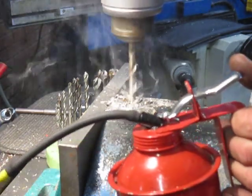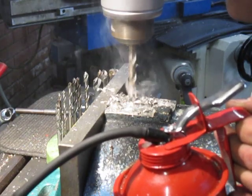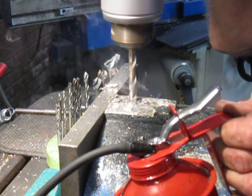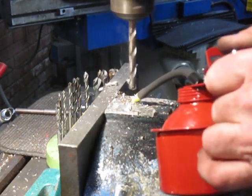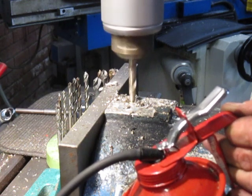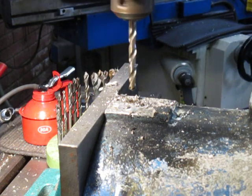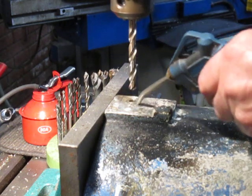Said before, the most important thing for me is to get through the stud so that I know exactly how far I have to go with whatever. So if even any piloting of any sort, we want to get down and get through first. And that then tells us if the stud has bottomed out or not. If it's bottomed out, the problem could be a lot harder. But if it drops like this is going to drop down, we don't know. That stud is probably somewhere in the vicinity of 12 to 15 millimeters long. So that gives us a proportion to this problem.